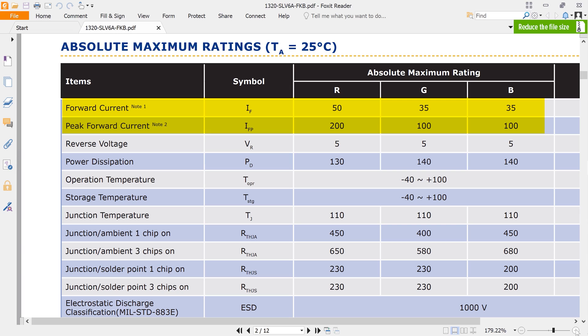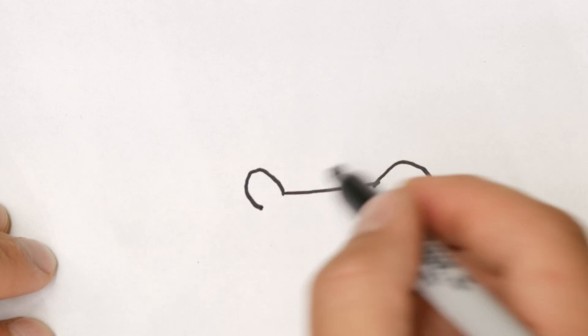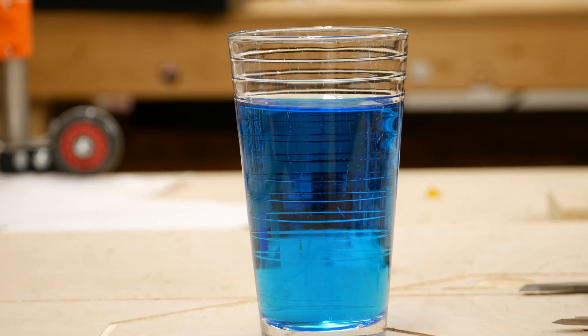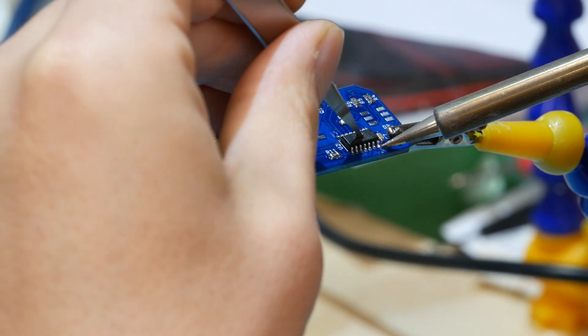The LEDs can technically handle larger amounts of current in short bursts, and by using PWM and very careful programming I could probably make sure I don't burn them out. Will this actually save power and work reliably? Who knows, but it's worth a try. Do you have any ideas for improvements? Feel free to post them in the comments. And of course, feel free to check out the build video that shows creating the dog collar light from start to finish — it's a little less technical and more just showcasing how fun the project was to make. Thanks for watching.